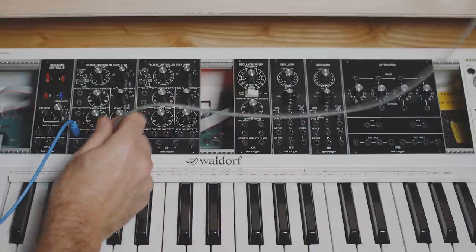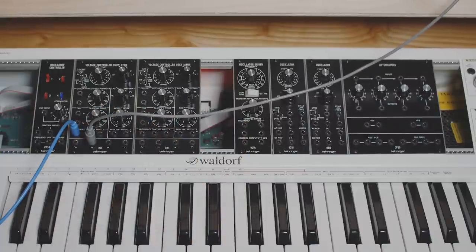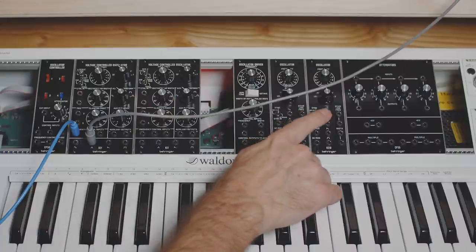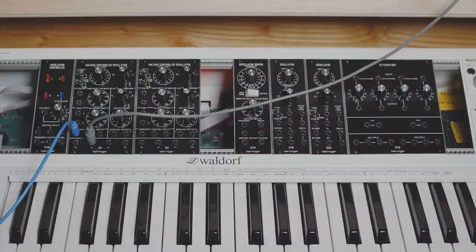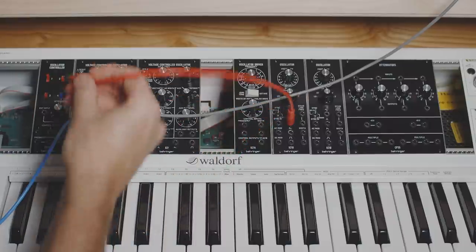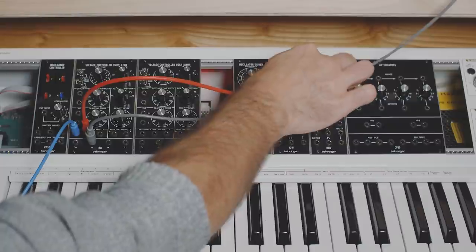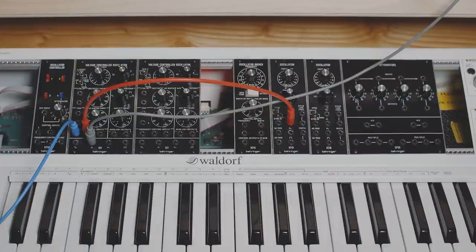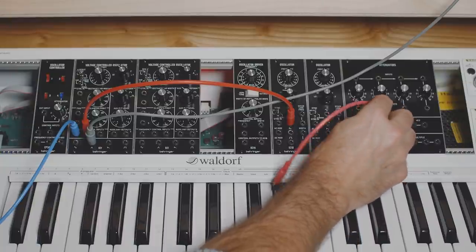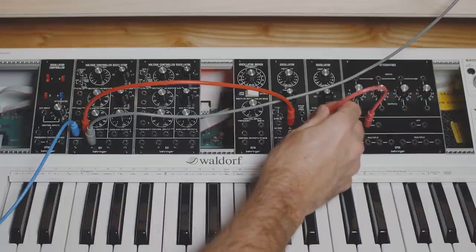So let's listen to our oscillator here at the end. And we're going to, first of all, just use the 921B on its own. So let's modulate the pitch with the triangle wave. So that's on low, tuned down as far as it'll go. Not really low at all, is it? Now let's take this minus 6 volts and apply it to the 921AB link frequency input.